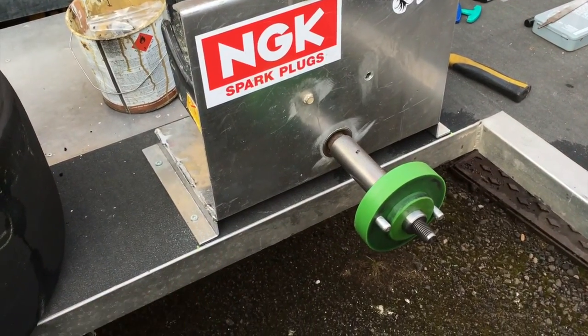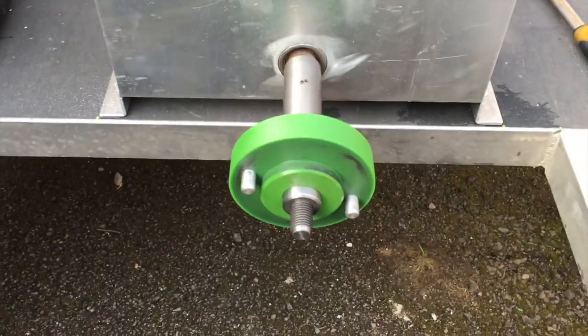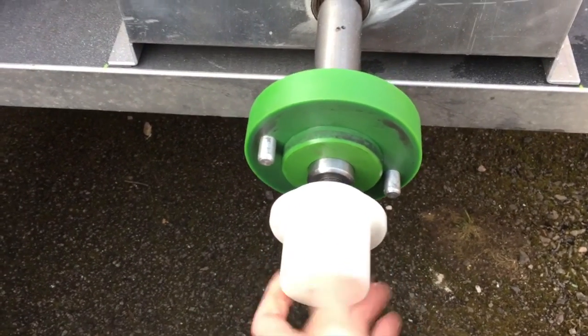I've copied the design of this machine from two of my friends, Paul Buckingham and Colin LaMatra from Guernsey, who kindly showed me how to build one. The best way to do it is you get a cement mixer motor, which has got a lot of torque but doesn't need a lot of current to run. You take the motor and gearbox, bolt it to a bracket, and then make a boss that matches up to the hub of the wheel. What you end up with is something fairly compact that runs off a fairly humble generator — like the one I've got, which isn't very good and was very cheap off eBay.